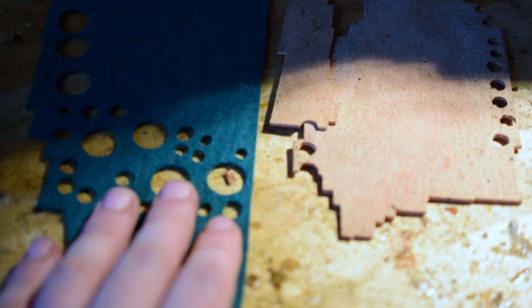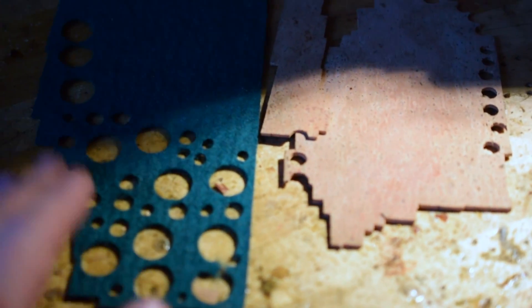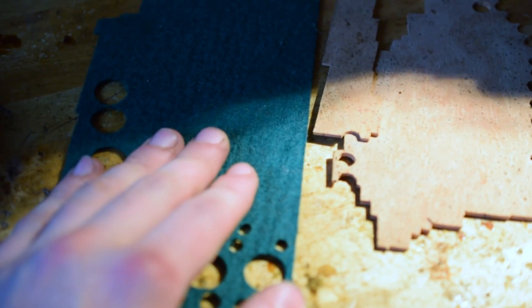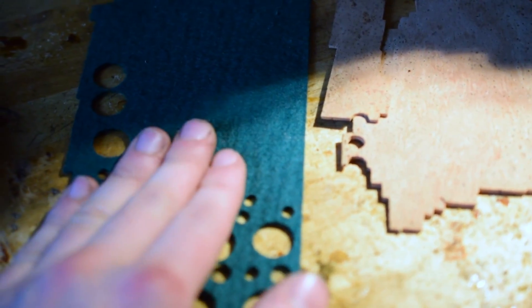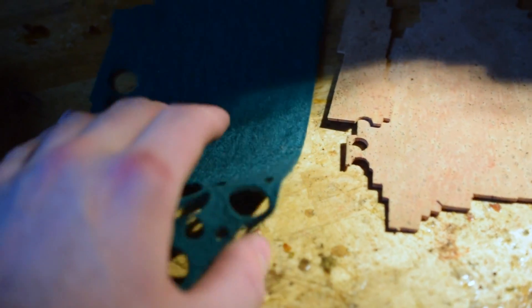So that's every material on this Mark VI from 1965. Briefly, here are the materials I've chosen to mimic the ones we just saw. It's just felt and cork — and it's amazing, but these two materials represent all you need to make a saxophone be quiet, feel great, and hold its regulation for a long time. For felt, I choose a green 100% wool felt. There are lots of different grades of felt out there — the stuff from the craft store is typically a blended felt made out of rayon, which is almost like a plastic. The difference with 100% wool is that it's much stiffer, much more resilient — you can even sand it.